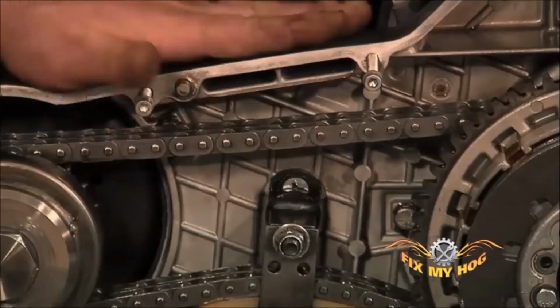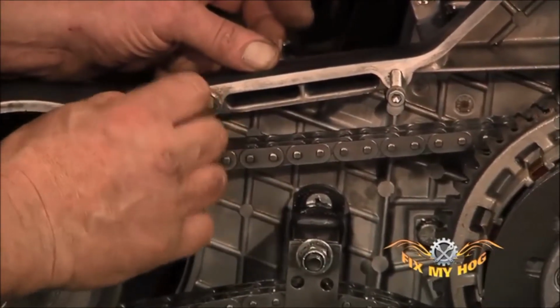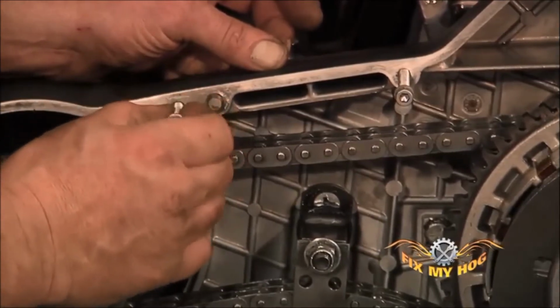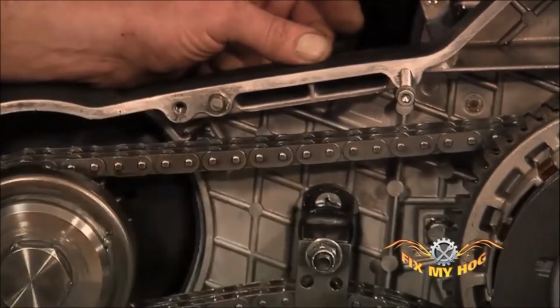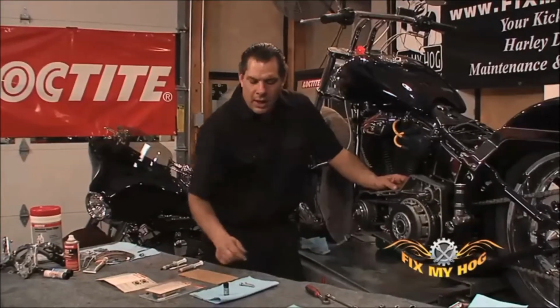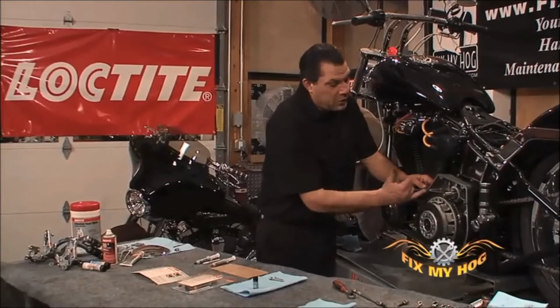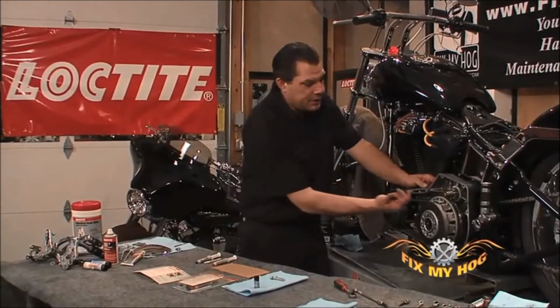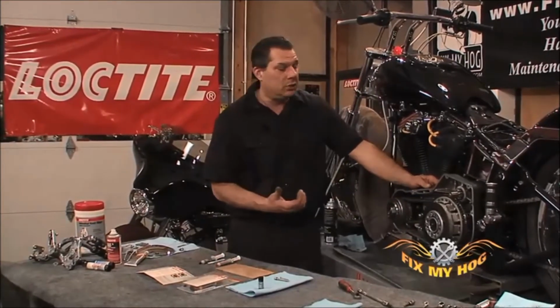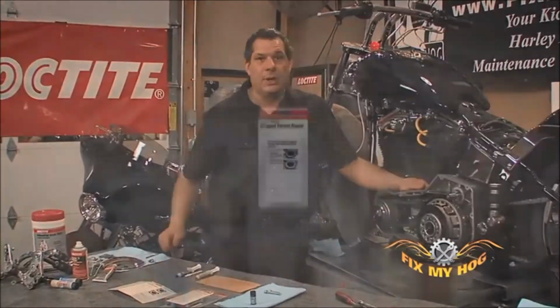This particular inner primary has two stripped threads. One in this location, as you can see, the bolt just wants to pull right out of them. And one here. Somewhere along the line, somebody might have over-tightened them. They might have run in the wrong length bolt, and they bottomed in the blind thread, causing the aluminum thread to pull away, stripping the threaded portion.